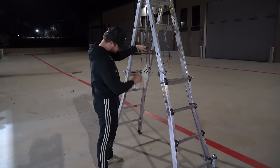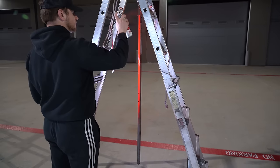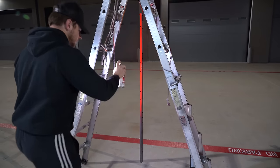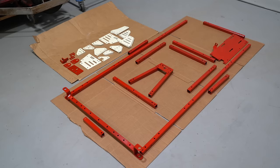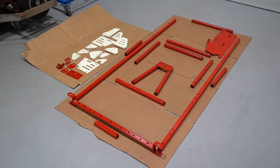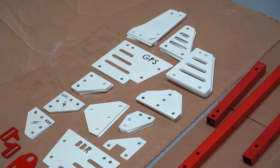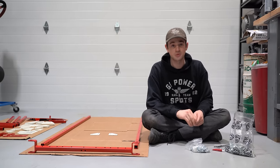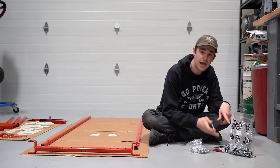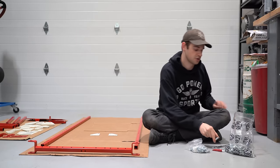If you're painting or powder coating your frame, do a dry fit up first to make sure everything fits correctly. Afterwards, if things don't line up, you may have some paint or powder coat in the bolt holes that needs to get cleaned out. We have a couple notes before we start: if we don't mention the size of the bolt, that means it's one of these many M8 by 45 millimeter bolts, which are about 1.75 inches long.